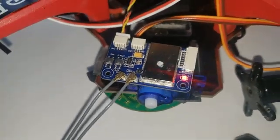Because we don't have access to the individual PWM lines without plugging in a messy setup, we're going to do the all-at-once ESC calibration method — and you can do this with the other setup too. First, power on the transmitter, raise the throttle all the way up with the drone still off, then plug in the battery. Press the safety switch — this informs the flight controller that the next time we power up, we want to calibrate the ESCs.